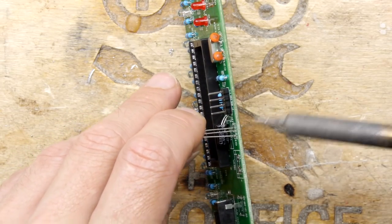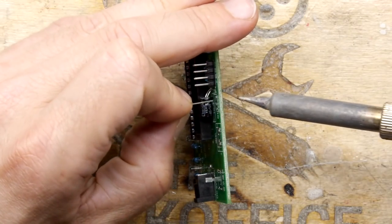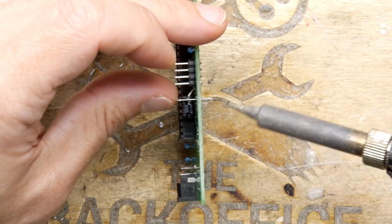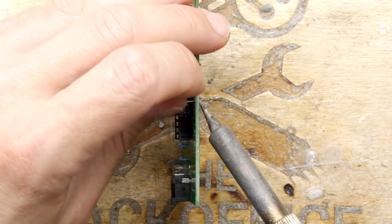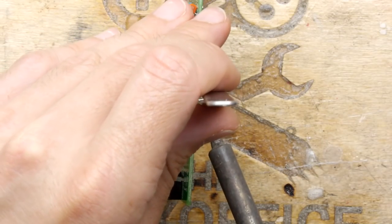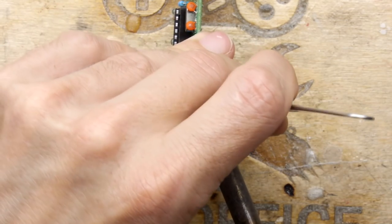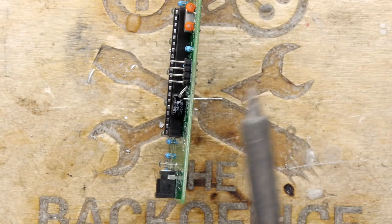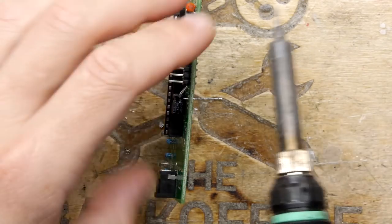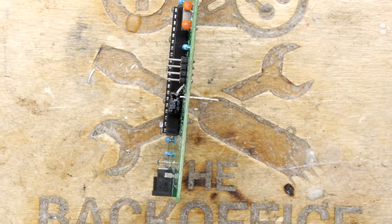Come on. Dagnammit. It's just got a piece of wire on its own. So that's homebrew solder braid there. I'm not applying any extra solder, I'm just pushing a wire through it and then pulling it out the other end. The idea being that you hope it's caught enough solder on its passage through. And don't use one like this which has got a kink in the end so it just gets jammed up. Okay, straighten that out.